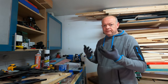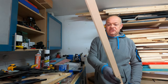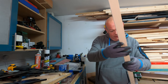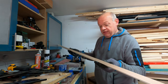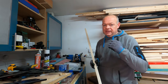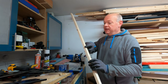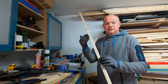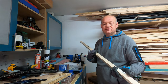I've actually got the board, and when I was sorting my wood out, I found this strip of plain milled timber — it's 18mm by 34mm by 2.4 metres. I recently created a router table insert for my table saw, so this is going to give me an opportunity to use that. I'm going to route out an edge to make it look nice, and then cut a channel in it to attach the back solid backboard and the actual whiteboard writing surface.